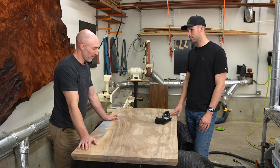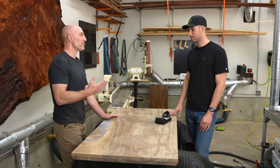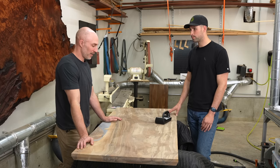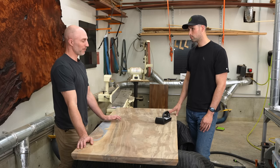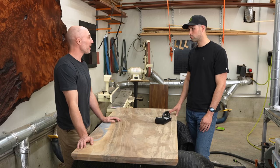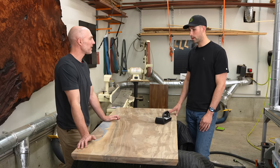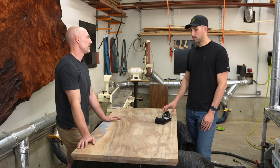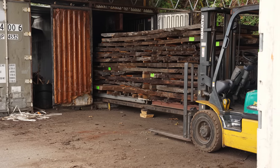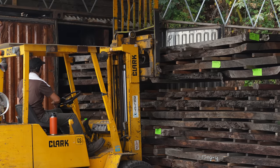In my thoughts today, I want to talk to you before I talk to the client — you want to have the options figured out first. Regardless of whether we start with new wood or try to salvage these ones, it's probably worth a shot to put them in the kiln. I've never put epoxy in the kiln, but it's pretty flexible especially as it warms up. What temperature is your kiln? 'We'll take these up to between 130 and 140 degrees.' We have put epoxy in the kiln and for the most part everything has gone fine.